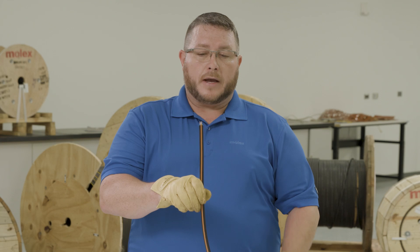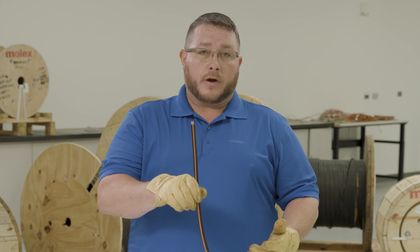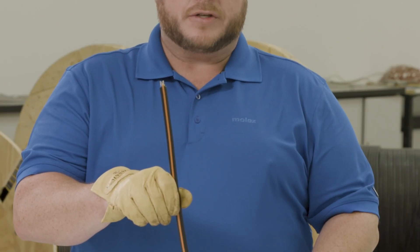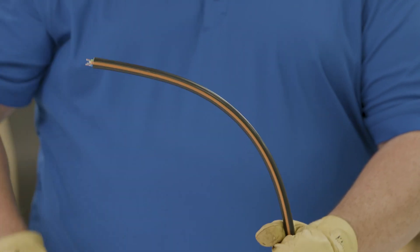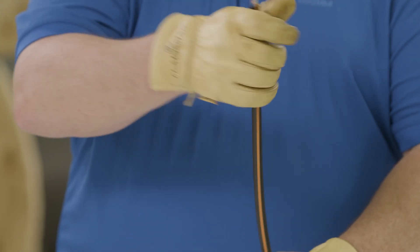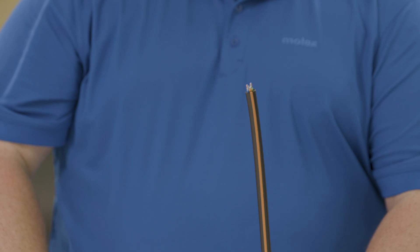In addition to the orange stripes, we actually changed the polymers of the jacket. We did this for several reasons. The primary reason is to facilitate resistance to mechanical damage. The second reason is to allow for cable memory. When we put this cable into a shape, you'll notice it maintains that shape, allowing for much cleaner handholes, cabinets, and any real installations where this cable is going to be exposed and routed.